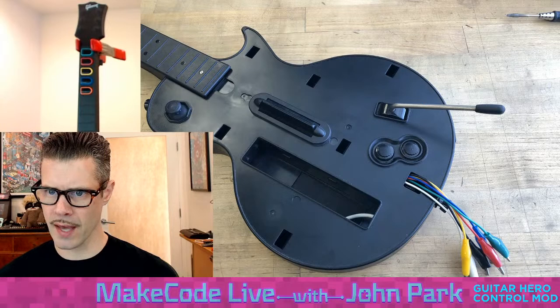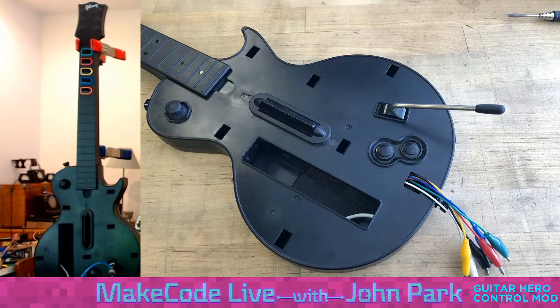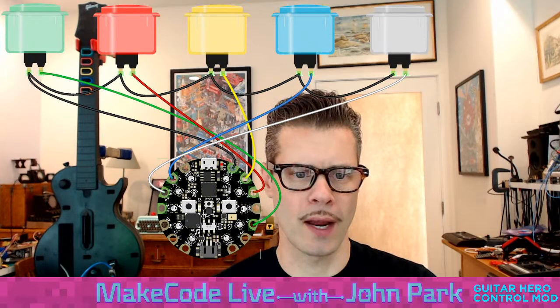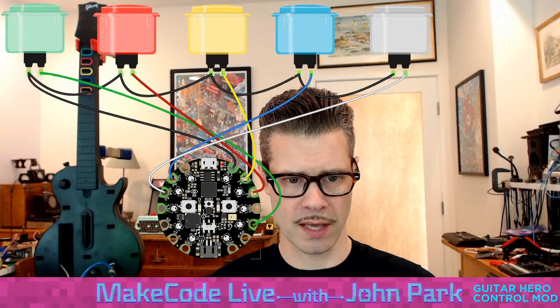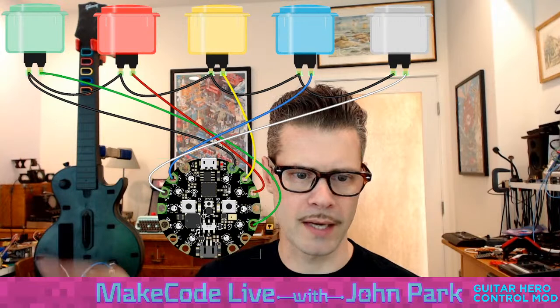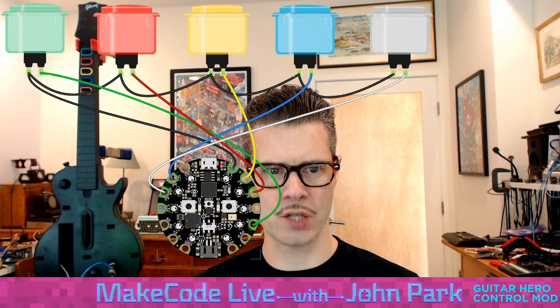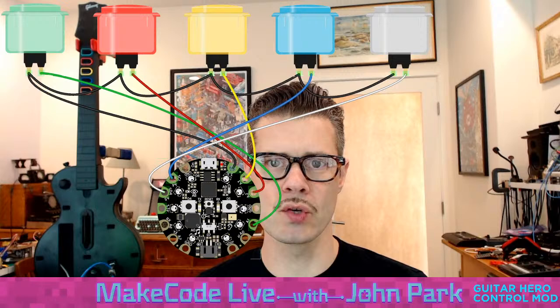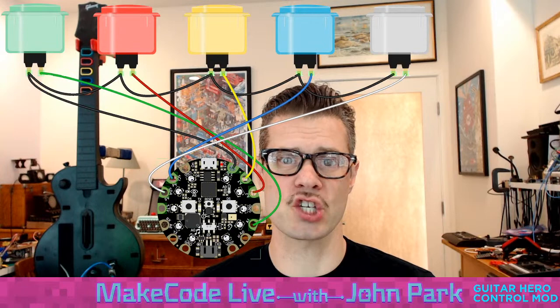To show you a quick schematic — this is inside Fritzing. I diagrammed out what the controls are. You can see we have a common voltage line there — a 3.3 volt line. That black wire is actually running voltage, not ground. We close all of those contacts with individual buttons to individual pins. So I'm not multiplexing or anything like that — just running to individual inputs on the Circuit Playground Express. Inside MakeCode, we're going to use essentially the touch/digital button block — when a button is pressed down and then up. Dead easy.